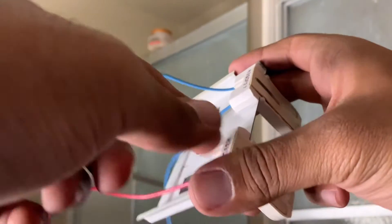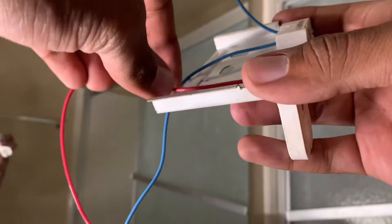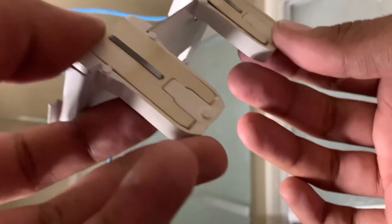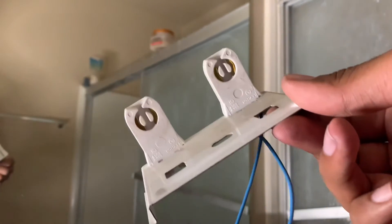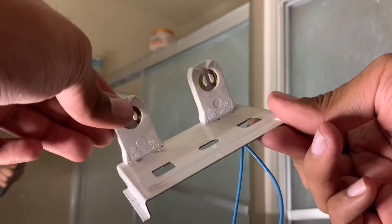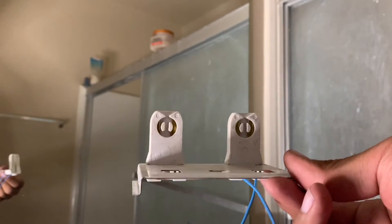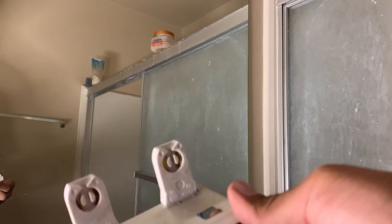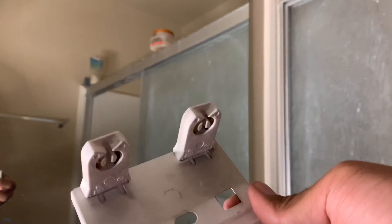This happened to me once when I ended up having to replace a fluorescent light socket after the socket broke while trying to change a bulb. Replacements are not hard to find, and I'll put the link in the description if you need them. When replacing the socket, you're also going to have to replace the ballast because of the old wiring. They say when you have a bad ballast you should replace the socket too, but if your sockets are in good shape there may be no need unless they are responsible for the failures.